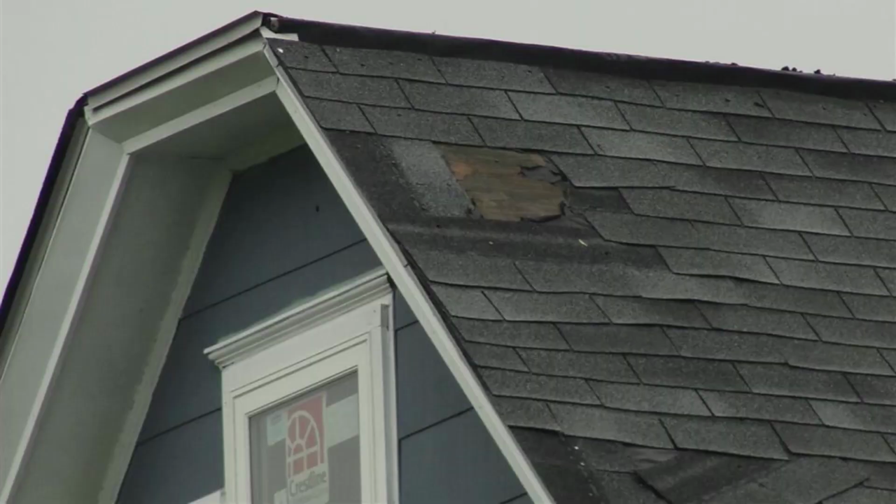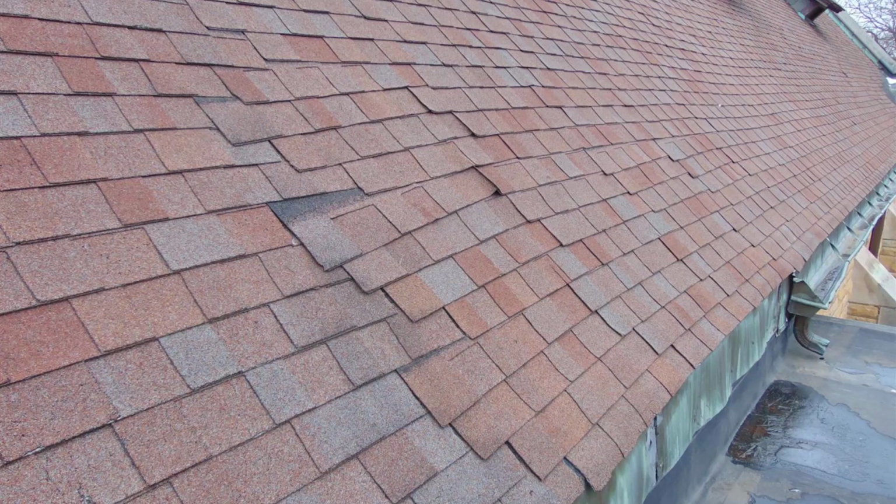in place. And that's why it's important not to have those nails located too high on the shingle. That's why that exact location really does matter. It's because we're catching the shingle below. So if you don't have that, your shingles are going to be much more prone to blowing off in the wind. And we've seen this happen in big sheets. We've seen huge sheets of shingles actually just sliding down because the nails don't have the right holding power.